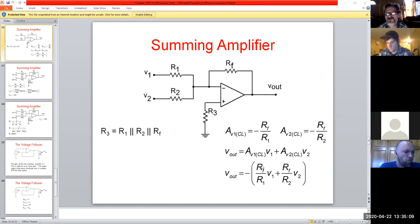So what we end up with, we get our voltage out, and because we're tied into the inverting input, it's going to basically throw it out of phase by 180 degrees. So we just establish a minus sign to that, and it should come out as a very simple formula. Just establish each leg at a time, and that should be your voltage output. As you vary what you have going into V1 and V2, your resistance values are fixed, so you could even come up with a ratio in this case, and then for each voltage change, it would just change what your voltage output is.